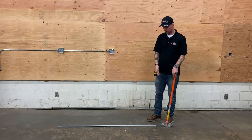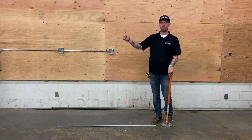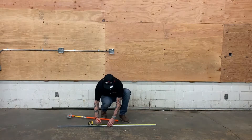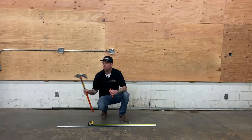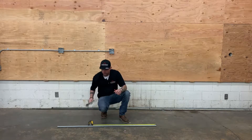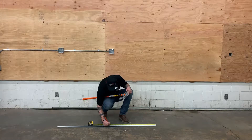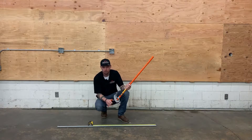For this demo, my box is here and I have a wall at 36 inches — 36 inches from the box, I need to go up the wall. The first step is to make a mark at 36 inches. That's my destination, that's where I want to get to. Now, every bender has its own deductions. On a half-inch bender it's 5 inches. So I'm going to deduct from my original mark of 36 and make a mark at 31 inches — that's 5 deducted from my original 36.